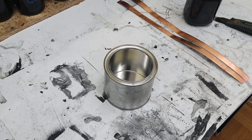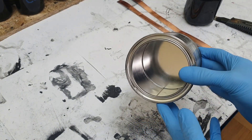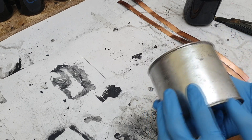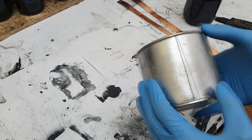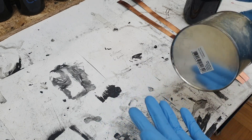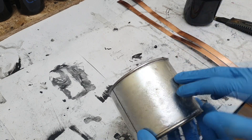For heater reactions with some acids or alkalines you need to use a Teflon container. But I will try to make a container heater out of this container. This container is made from stainless steel, and stainless steel is of course conductive, so I coated this container with some insulator — basically a coating for high temperatures. On this container I will put two copper strips for the electrodes.